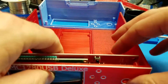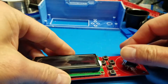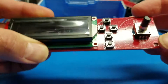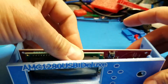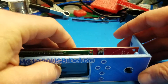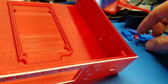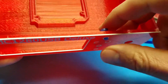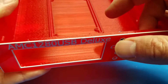After that, you connect the LCD here. You can also connect the encoder like that and then solder it so it goes through like this. When doing assembly of the board in the box, you will also have to print some little buttons. You may have to massage them a little bit to make them easy to press and release.